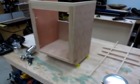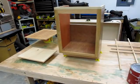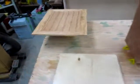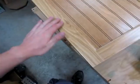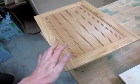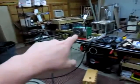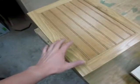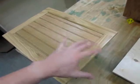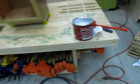So anyway, I'm going to go ahead and put the camera on a tripod here and get painting. Okay, so I've got my third coat on here, and I am really liking the way this is looking. It looks really good. The first 2 coats I wasn't all that happy with. I used a larger diameter nozzle, which is the one recommended in the manual for my HVLP here. I switched to a smaller nozzle, which is what the person at the store where I bought my urethane recommended, and it looks a lot better.